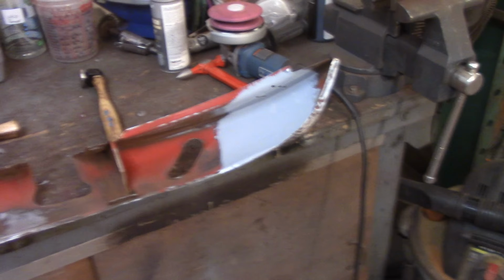So I've got some degreaser in there, that Purple Power stuff that I use, and I'm just going to hit it with Scotch-Brite pads and whatnot and try to get in there and get it cleaned up. And again, I'm not going for perfection in there, more so just to try and get some of the grime and grease off and then clean it well enough that I get good paint adhesion. Probably not the best image due to lack of light, but I'm in the bowels of the bonnet here, and you can see this is the front top of the wheel arch.